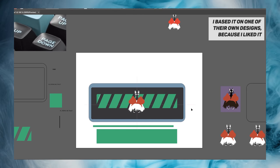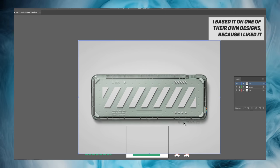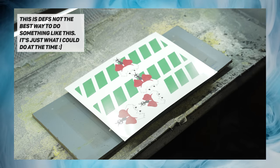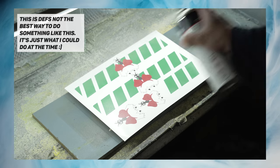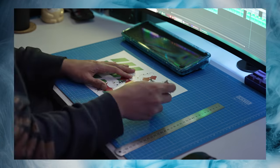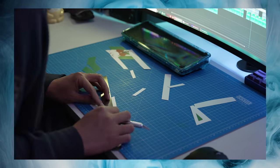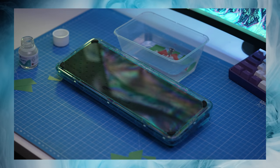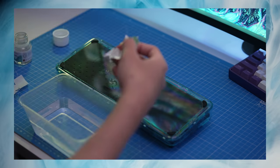The mods in particular are very sharp, but pretty good in regards to rattle. Only my left shift had a bit of a tick, but everything else was pretty good, which is fortunate because these are plate mount stabs. Then I tried cherry profile keycaps, and you can definitely hear how much of a difference different profiles make. Then I put in some banana splits, lubed and filmed, as they should sound nice — and I was a bit confused at first as to why they sounded so mushy and dampened. My unit had north facing switches for some reason, so the caps were clashing with the switches, but on the actual final boards they'll be south facing, so you'll be all good to use whatever keycaps you want.